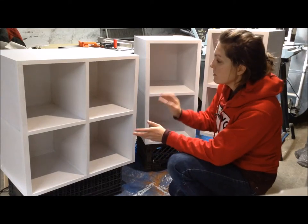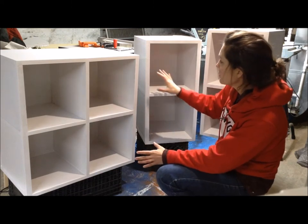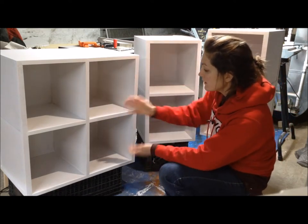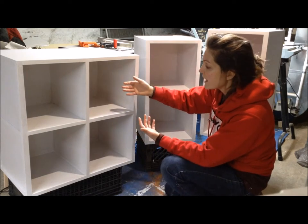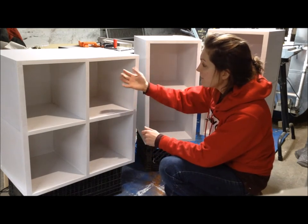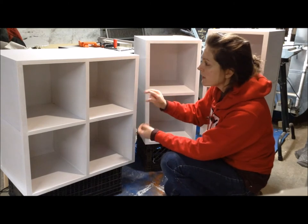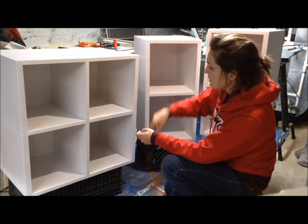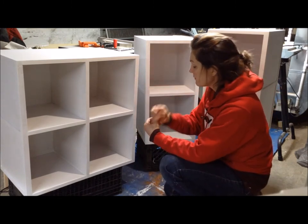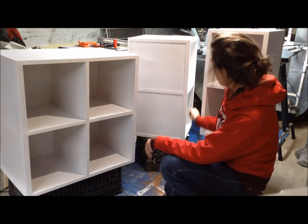This next series of videos is going to be a two-part series where I show you how to build what I'm calling an art desk. It will have three storage-like cabinets on the bottom — two smaller ones on either edge, and one in the middle which are going to fit modular cubbies the customer already has, so you'll be able to just pull your stuff in and out. They won't have drawers or cabinet fronts. The basic construction is made out of three-quarter-inch plywood that's been rabbeted in the corners, and the shelves are dadoed in place with a very thin face frame, as well as how to hide screw holes on the side using decorative elements.